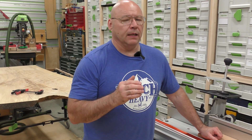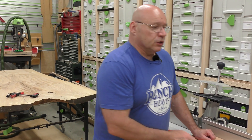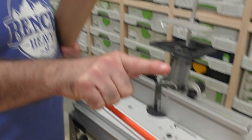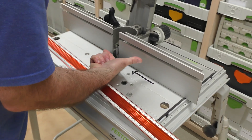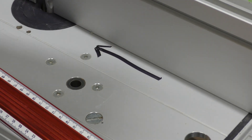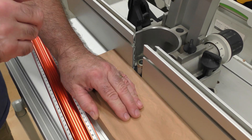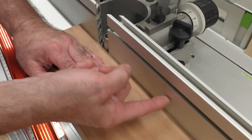Another application is a correction from my original video — two folks called me out and I want to make sure you understand: don't get complacent, always understand the flow of the material. In a former video I showed the router going one way, but with a router table it's upside down so it goes the other way — that's why I make an arrow on my router table. I'm going to set this up with the straight edge to use it as a jointer. See how it flows perfectly — even here and here.